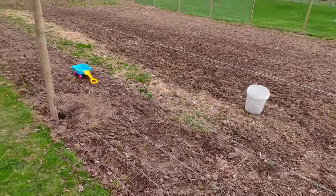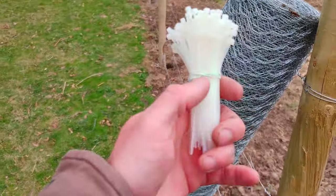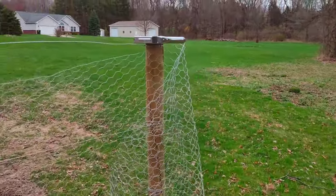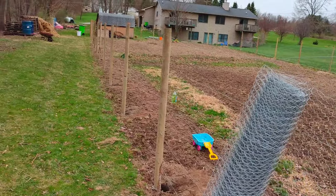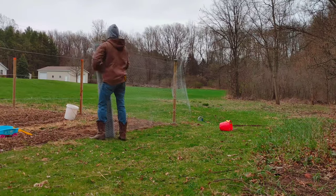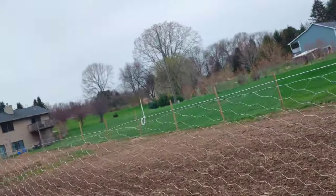Now that all the wire is done, we're ready to start throwing up the fence. For this part we're going to need a staple gun and some cheap tie wraps. Since I'm doing this alone, I hit this top corner with a staple just to hold it in place while I roll this out to the next post. Now it's time to take the tie wraps and use them to tie the fence up to the wire every two feet.